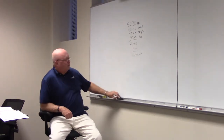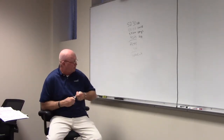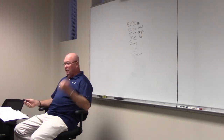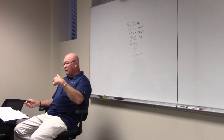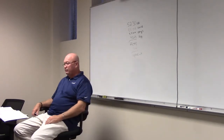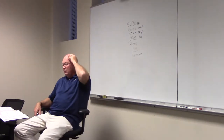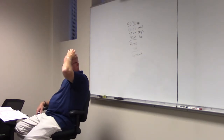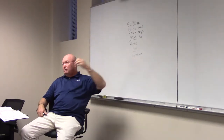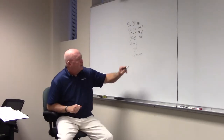All right. And we want to know our service size. What are we going to do with that 23,412 volt amps, Cameron? If we want to know our service size, we've got to get the amps, right? And this is volt amps. This is volts times amps. And so we want to get to amps. On a single-phase house, how do we get from volt amps to amps? What do you think we do? Just think about it. If this is volts times amps, that's volt amps or watts, okay? Divided by volts. Thank you.